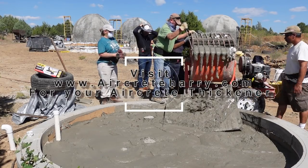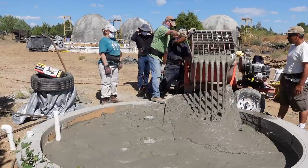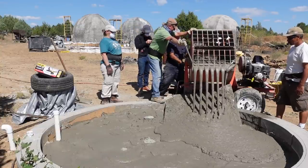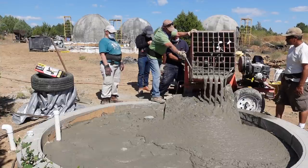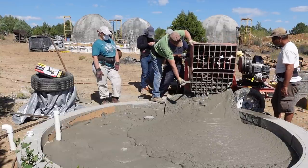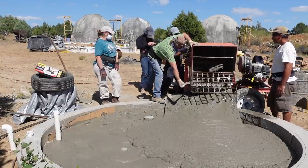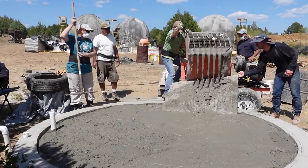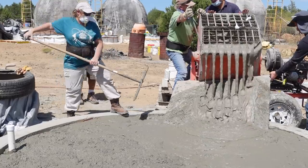The great thing about this system is the dome shell is reinforced and I can add as much reinforcement as I like. For this workshop I did something a little different than the domes you see in the background — those were made with the EPIC system: expanded polystyrene paper infused cement. There are different recipes for EPIC with different strengths and insulation layers, but for this smaller dome we're building we used two stucco shells — portland cement and sand only.